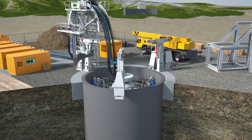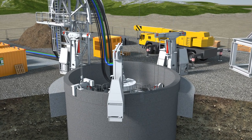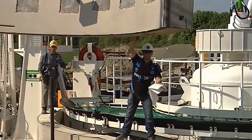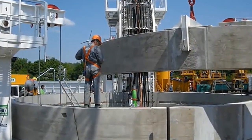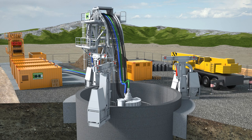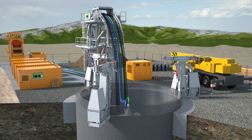As the shaft sinks lower, pre-cast concrete segments with rubber sealing gaskets are bolted in place on the top of the shaft. Excavation, shaft sinking and construction of the next ring can take place continuously. The molds for the segments are also supplied as part of the shaft sinking equipment package. Segment dimensions are designed to suit the shaft's purpose. The daily sinking production is in a large range from 1 to 5 meters, depending on the diameter, geology and working hours.